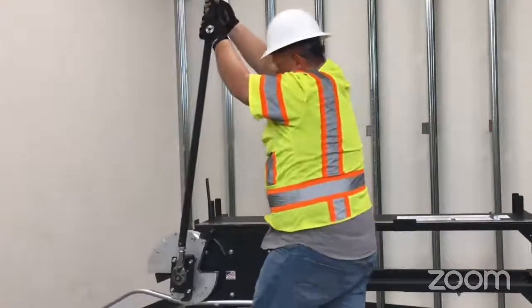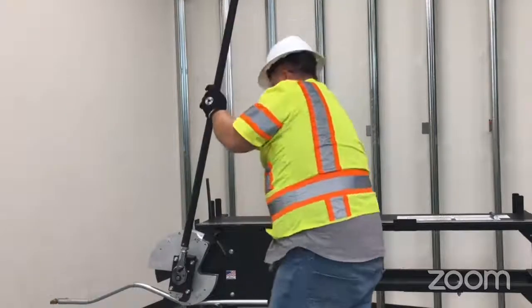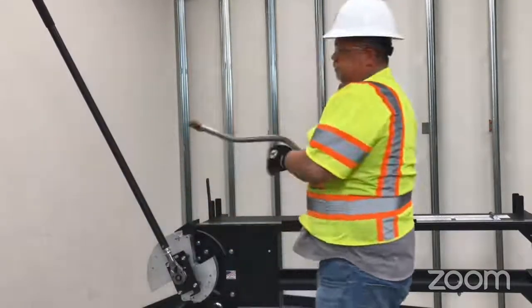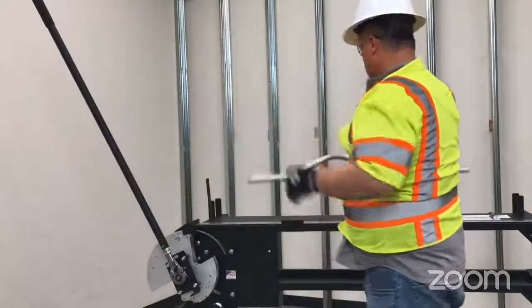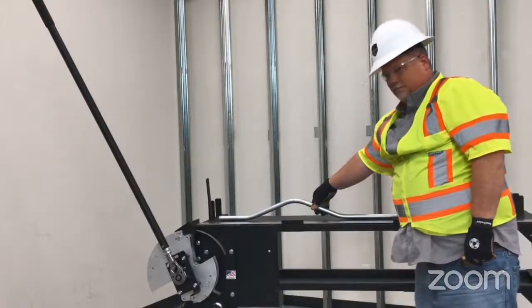Got it lined up — sighting the level, sighting down the groove. We pull that last bend. It's easy to duplicate the angle because of the protractor; it's not dependent upon how the bender is standing up off the ground. We put it on the table to check — make sure it's flat and that we got the right amount of saddle. And it just feels good when you get it right.